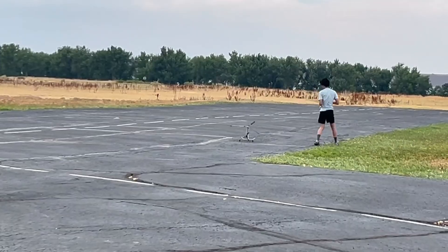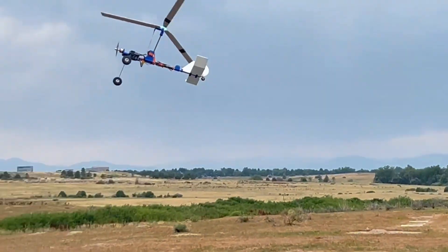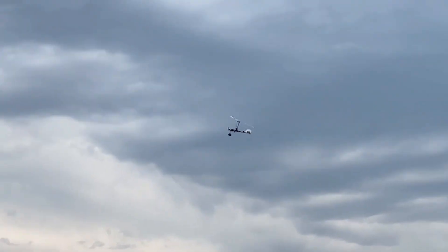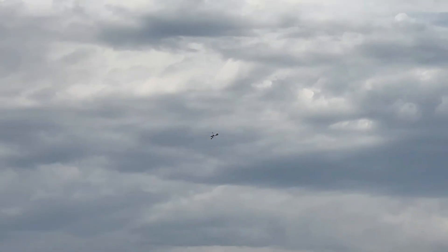For the last flight that day it was getting really windy, so I thought it'd be a good opportunity to see how it handles turbulent wind. I was happy to see it really wasn't getting thrown around that much. I was concerned about going downwind because I was afraid the aircraft would lose a lot of altitude due to a decrease in rotor RPM, but I was surprised to see it just went a bit faster and the rotor RPM generally seemed to be unaffected.